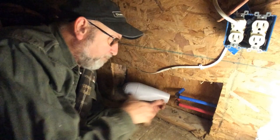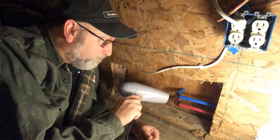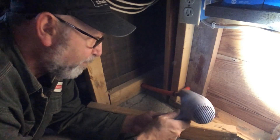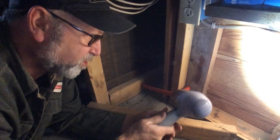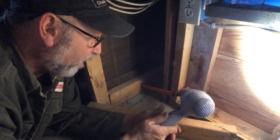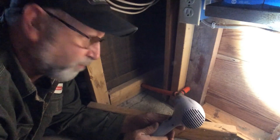I don't see any broken pipes yet, and I'm going to switch over to another couple of places. This one here I'm assuming is baseboard heat because it's three-quarter inch. I'm just kind of heating up the elbow. The building is coming up to temperature, but this is just going to speed the process up. This is the safest way to do it — with a hairdryer. Don't ever use a torch. I'm going to stay on this one for a little bit and then move to my next location.